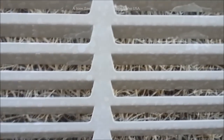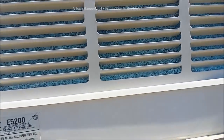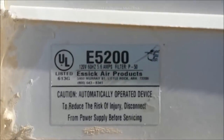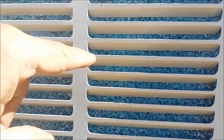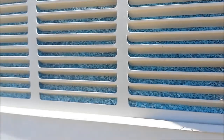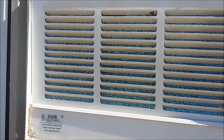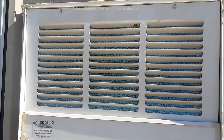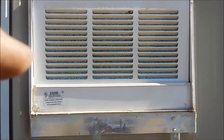I've done this on one of my other coolers - I'll show you that right quick. This one has been in here for about a year and a half. I have my old cooler back in my machine room and it is doing a hell of a job. Its temperature has dropped from about 62 to 55 degrees output temperature for the air when it's 90 degrees outside and about 30 percent or less humidity.